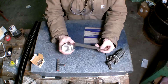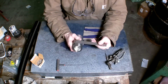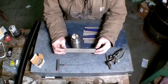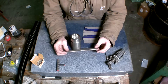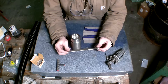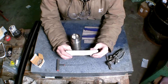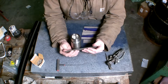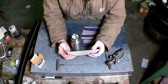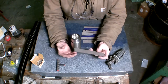Before I hot form these, I'm going to hot form them around this mandrel that I've already made. This is a piece of two-inch, two-and-a-quarter stainless. I do not have a roll. Titanium is about as strong as steel, a little bit more as far as tensile strength, but the yield strength is higher — what that means is it doesn't bend as readily. It acts a lot more like stainless steel, maybe like a higher-chrome stainless steel. I have a set of rolls, but it just wouldn't do it, so I came up with the hot forming, and it worked really well.